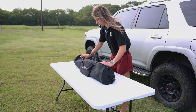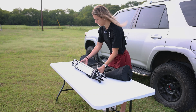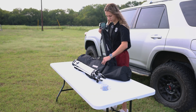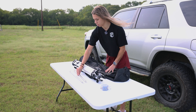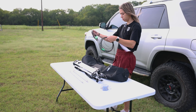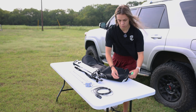The Hextenna Deluxe from Alpha Antenna is a portable HF, VHF, and UHF antenna with three configurations. As a dipole it covers 2 to 40 meters with telescopic stainless steel whips nearly 18 feet long. As a vertical it operates on 10 to 20 meters plus 220 and 440 MHz using a 31-foot counterpoise, and with additional elements it can also be configured as a Yagi for directional gain.